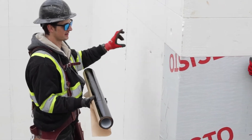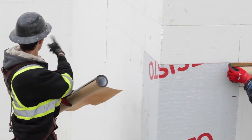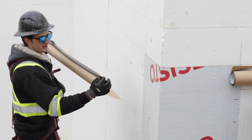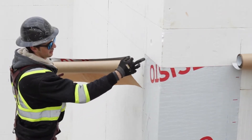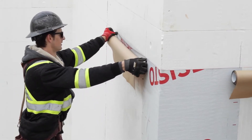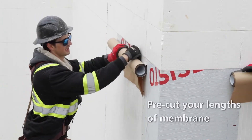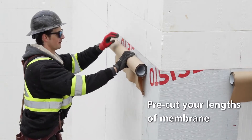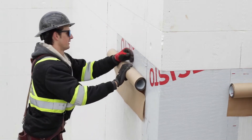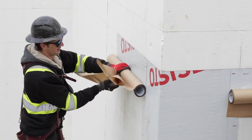We need a chalk line 6 inches above our grade — the grade is down around here, so we went up 6 inches and snapped a level chalk line across so you know where to start. They have great instructions online you can check out, but you just want to go on the overlap they give you, go on your chalk line, and put it on. It is sticky, which is why you want to pre-roll your cut rolls. We went 91 inches for ours. I'm on a 3-step bench just to make my life easier since I'm not 91 inches tall.